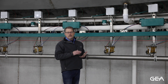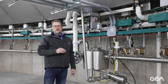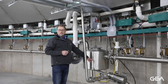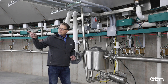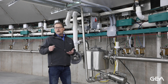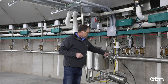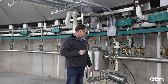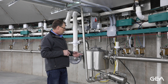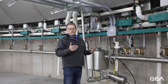On this system there are two receiver systems — on each milk slope we have 20 milker units, so 40 milker units come into one receiver. This is a 50-gallon receiver running on a three-horsepower variable-speed pump. We pump the milk to the center, it goes through a swivel and out to the milk house, where we put it in the milk wash reservoir. That allows us to slowly pump the milk through the plate cooler, chill it down to 34–36 degrees, and put it on a tanker. Air actuators close the system down and create the slug to wash it. Serviceability — such as the ability to unplug and replace a motor in about five minutes — keeps the milking system up and running 24 hours a day.